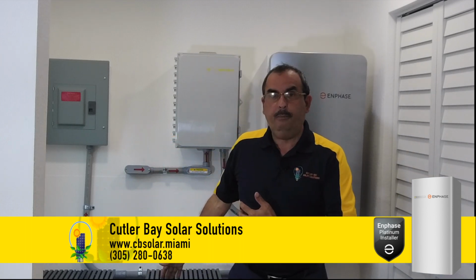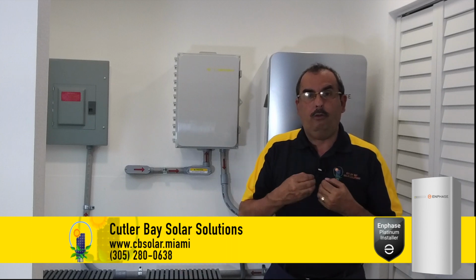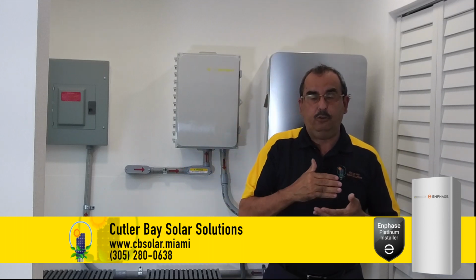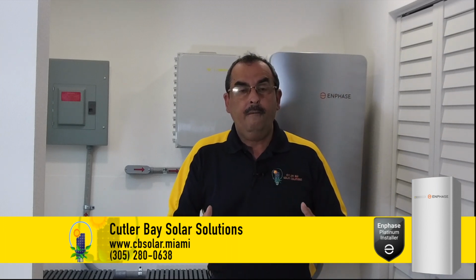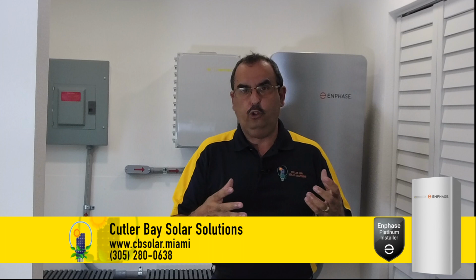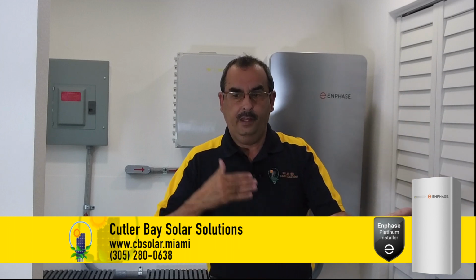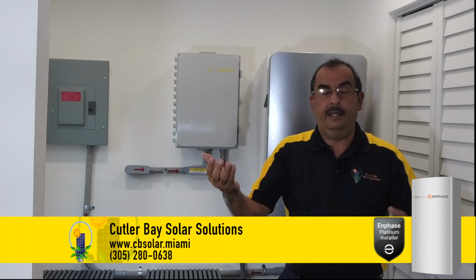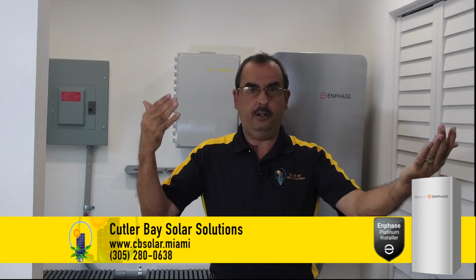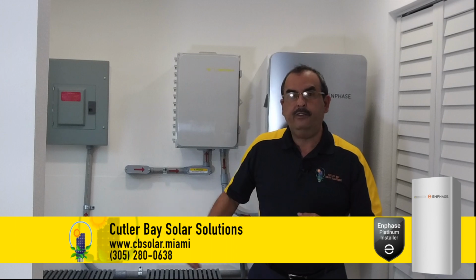The main difference with the Enphase Ensemble in charge battery is that it is cobalt free. The lithium iron phosphate battery, being cobalt free, creates a safer chemical environment that does not create as much heat, allowing the battery to operate in different and safer environments, with passive cooling, meaning there is no fan, no mechanical instrument inside your battery to keep it cool. Tesla PowerWall 2, you have to have a fan to keep it cool. If the fan breaks down, the battery shuts down. By not having that opportunity of breaking down in the Enphase Ensemble in charge, you don't have to worry about your battery shutting down with a mechanical failure. Non-mechanical failure, much safer. Cobalt free, it is a much safer chemistry from the Enphase Ensemble in charge.